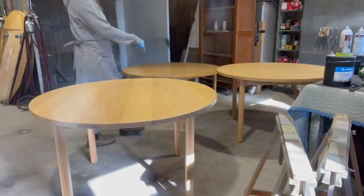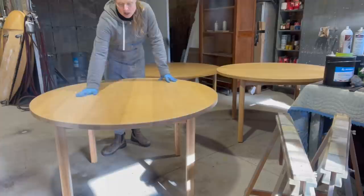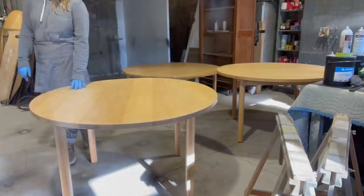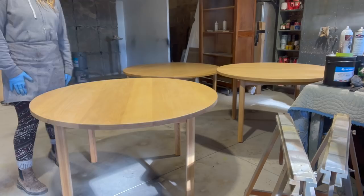table department. We've got color work done, two coats of the crystal conversion varnish, and that's sanded down, and I'm ready for the last coat of conversion varnish on these guys, and that will be done for these three big ones. These are a little bit trickier to finish because they're bigger, so it'll be good to get these done. I'm gonna throw a coat of the conversion varnish on there. I'm just gonna mix it up and shoot it and pray it works, looks good.